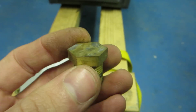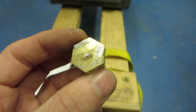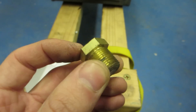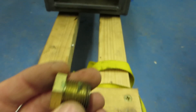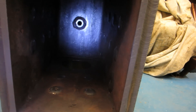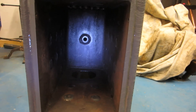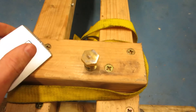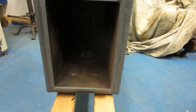For those that don't know, this is called a fusible plug. The centre is drilled all the way through and it's filled up with lead. Lead melts at a lower temperature than brass, so when the plug is in there on top of the fire — the fire sitting down here, directly above — if the plug becomes uncovered with water, as in you've let the water level get too low, the fire melts the centre out of the plug, which dumps any remaining water and steam on top of the fire and hopefully puts it out. So it's a built-in safety mechanism.